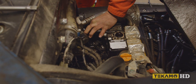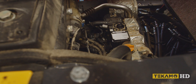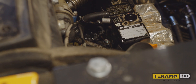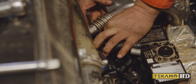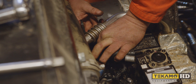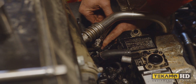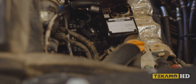Wind them in as far as I can by hand. Now we'll feed this power rail back in. This wire is slotted - we have to hold the wire in as we tighten up the nut, which can sometimes be a little bit difficult. There's a ratchet to tighten them up. These don't have to be too terribly tight - they're just little studs. Now the glow plugs are in, power is hooked up, power rail's on.